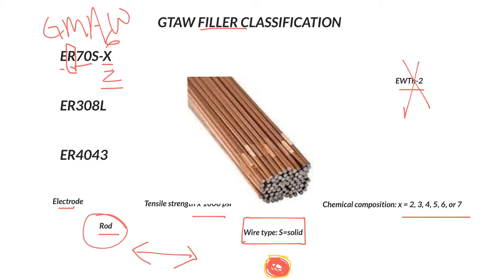That's pretty much it for steel. We also teach a little bit of stainless, so we might use an ER 308L rod. There's also 309, 316, and 347 — a whole bunch of stainless rods — depending on what grade of base metal you're welding. The L designation simply means low carbon, meaning there are small amounts of carbon in the filler rod, which we discuss further in metallurgy.